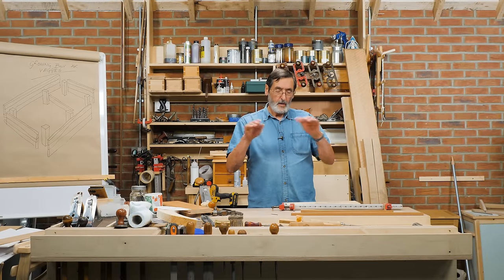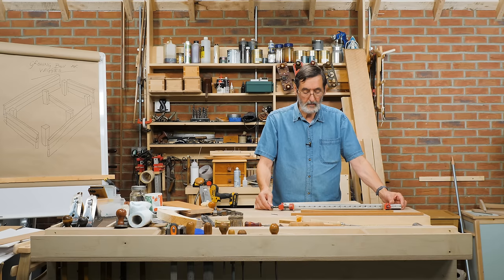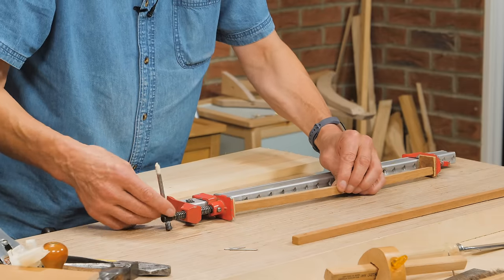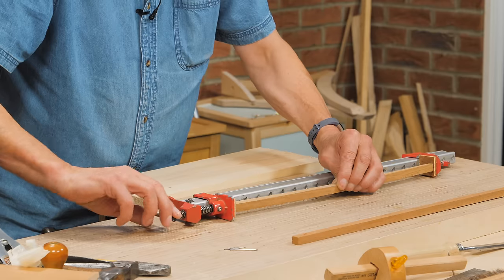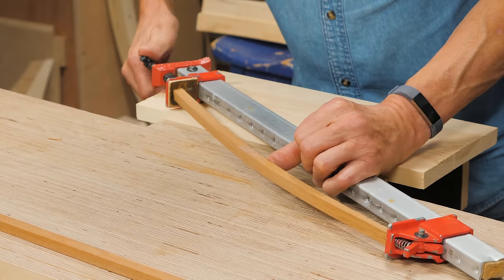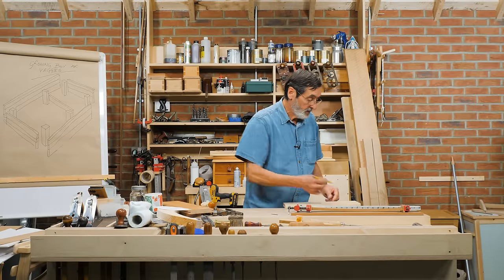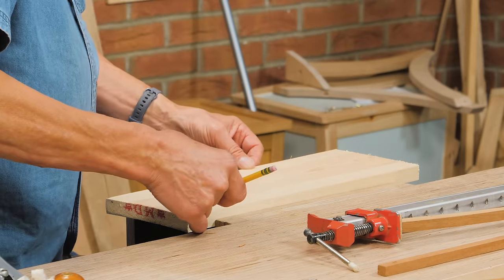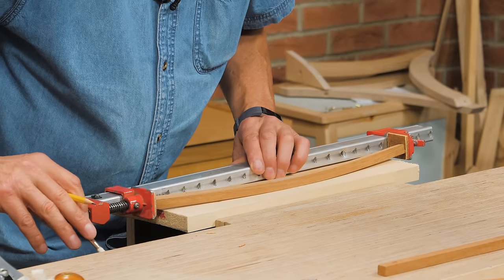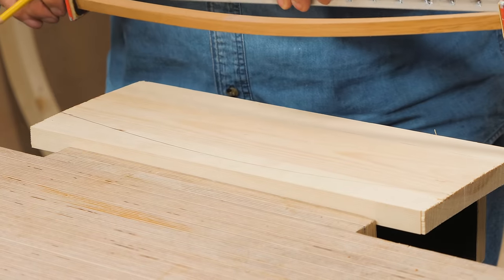Sometimes you've got to put an arch onto a piece of wood — maybe the underside of a table top, a chair seat rail, or something like that. I've got this piece of wood in the vise. Take a stick between the jaws of the clamp and start cinching it, and as you turn the tommy bar just push the wood out until you've got a shape that you like. Mark a position on the piece of wood where you want the arch, put the arch onto the piece, see how it looks, turn it if you need to, and you can mark your arch and have a nice arch on there.